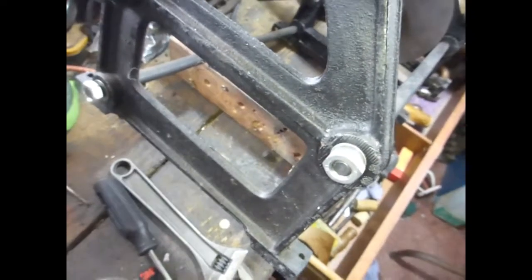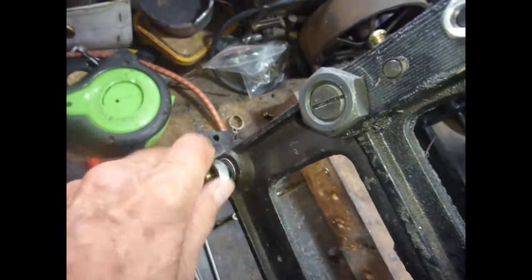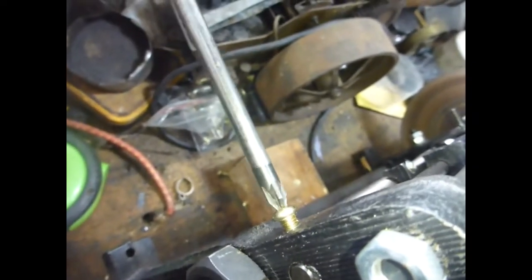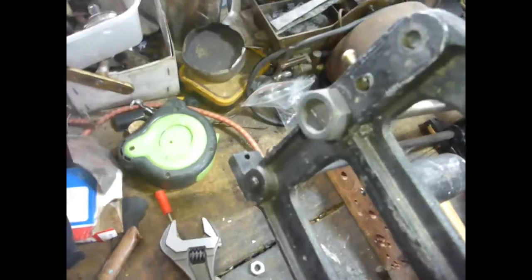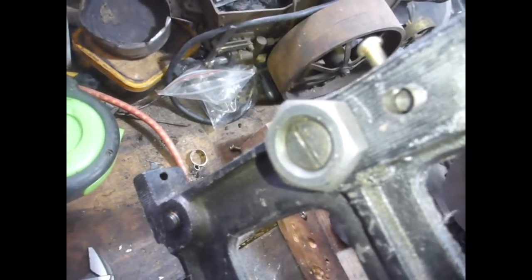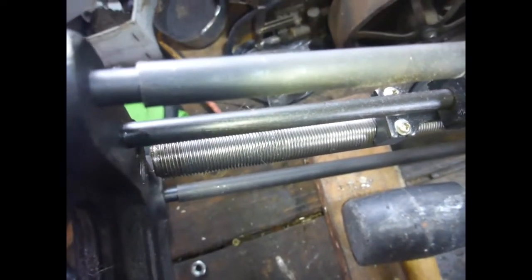So it's simply a matter of removing these three nuts and loosening this lock screw at the back. You don't need to undo that large nut — that's a sort of pre-tensioner really for the threaded rod there. You may have to adjust that occasionally. So once you remove the nuts, it's simply a question of tapping and knocking the chassis out.